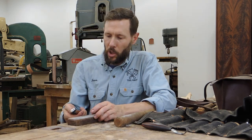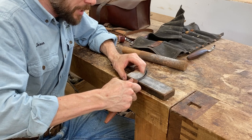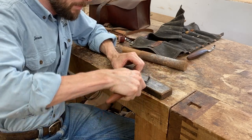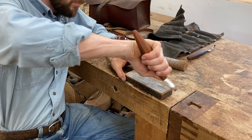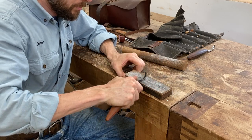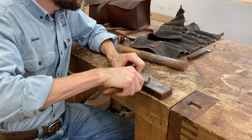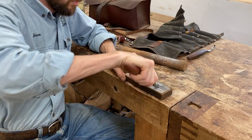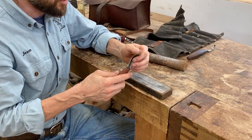For polishing I'm going to start with the outside where we have that burr. I'll remove the burr by laying the blade on the strop and rocking it until I'm right down where it's on that cutting edge, just a little bit of pressure, and push it away. Now I'll check that — yes, the burr is gone and it's nicely polished.